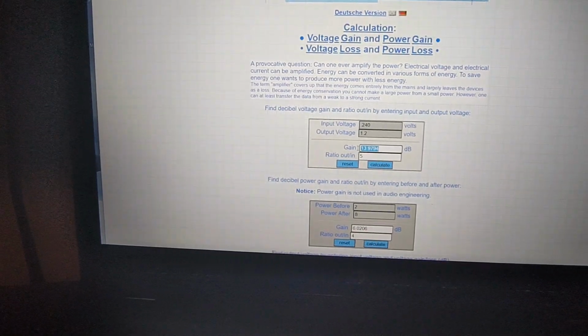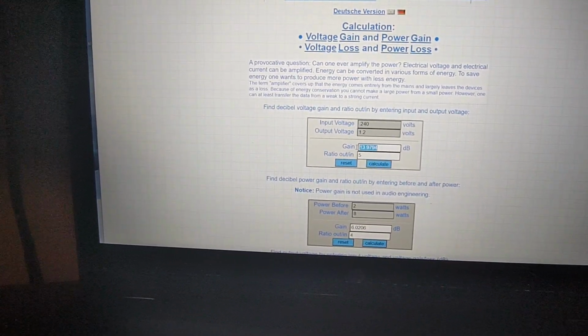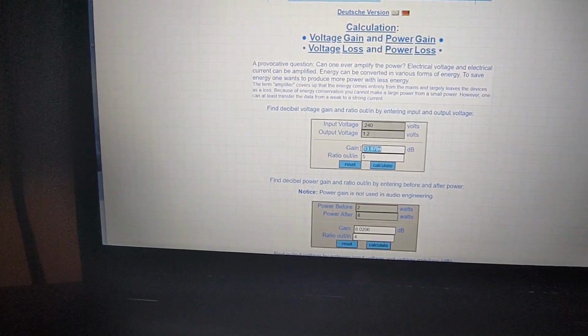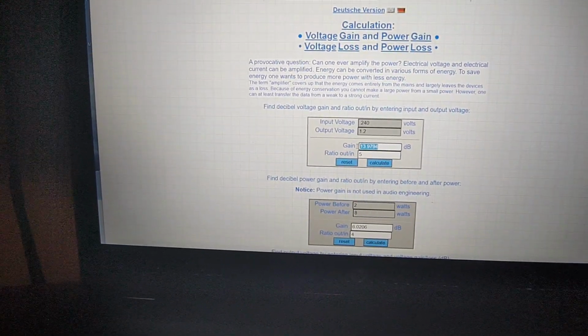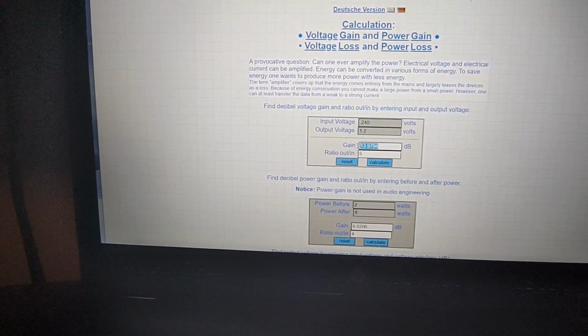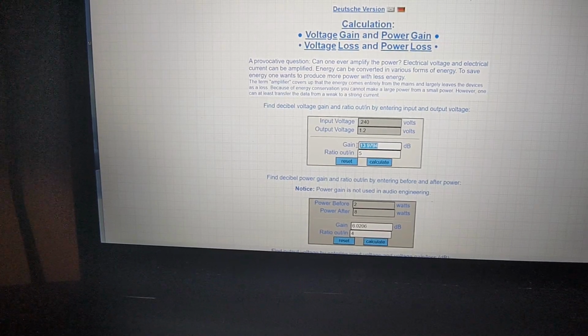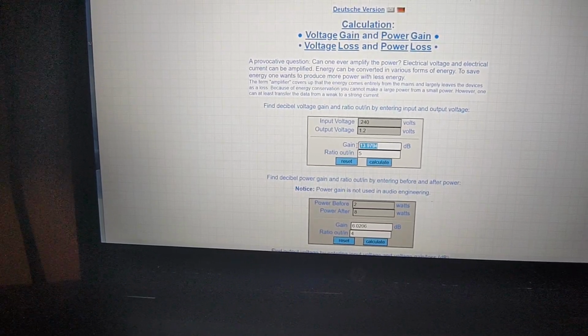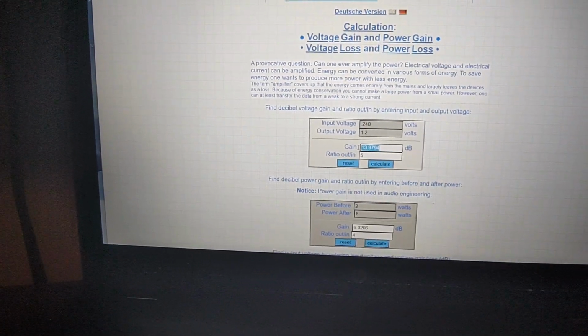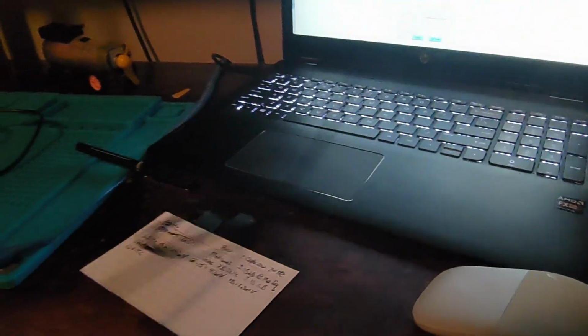This would be something I would look into, because this could potentially be an issue in the amplifier section. Now again, I don't have any of the tech data, but to be a whole dB, essentially 1.1 dB off, that to me is probably slightly out of tolerance, but what do I know? Okay, so we're going to repeat this process again for the mid-range frequency.